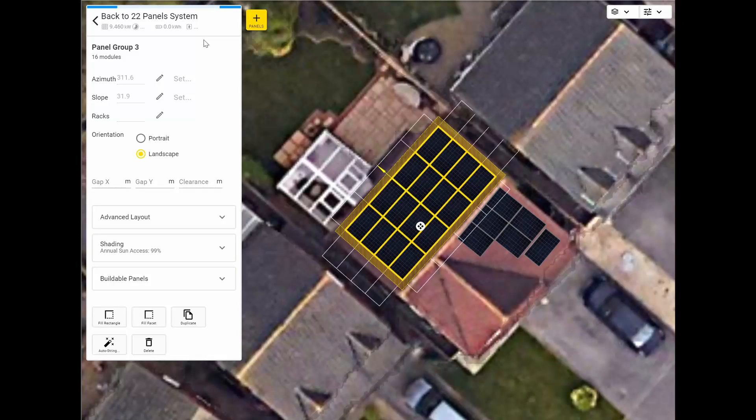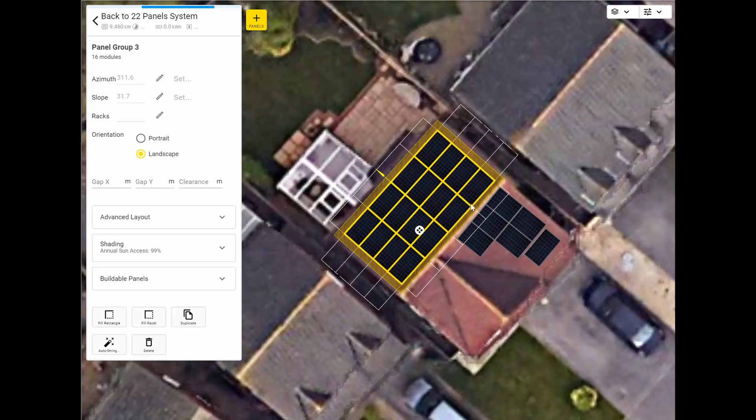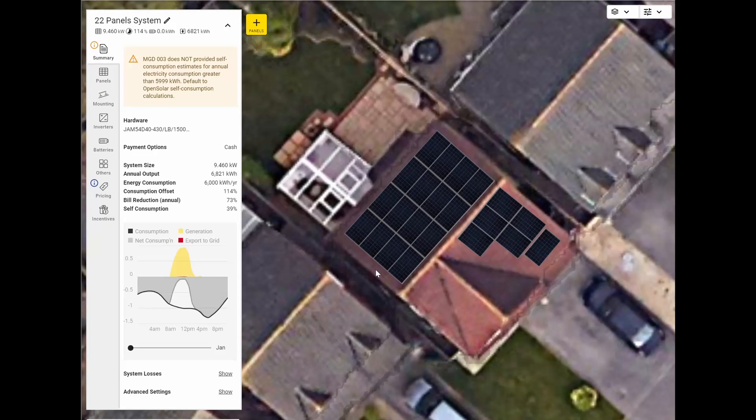It's calculating... 6,807 kilowatt hours. Putting an extra four panels — bearing in mind that panels are one of the cheapest parts of the system. A lot of other components haven't dropped majorly in price with inflation, but panels themselves have come down significantly and become more powerful. So if we go with a four-by-four grid and squeeze 16 panels on the back, the overhangs look comfortable. We could go up a ladder to measure, or try to count the tiles, though that's not always accurate — my tile type could be between 320 to 350mm depending on the overlap the roofers used.